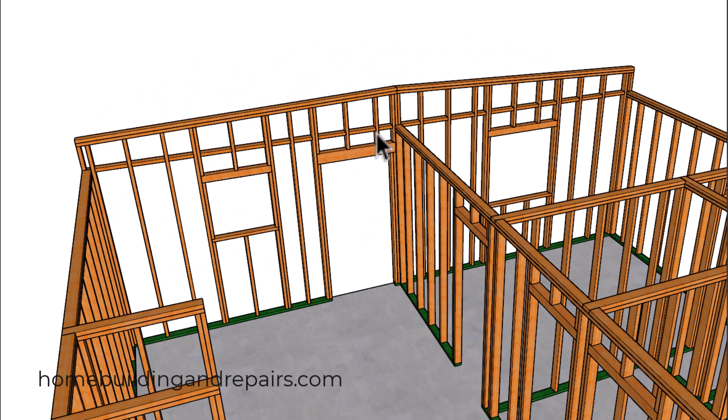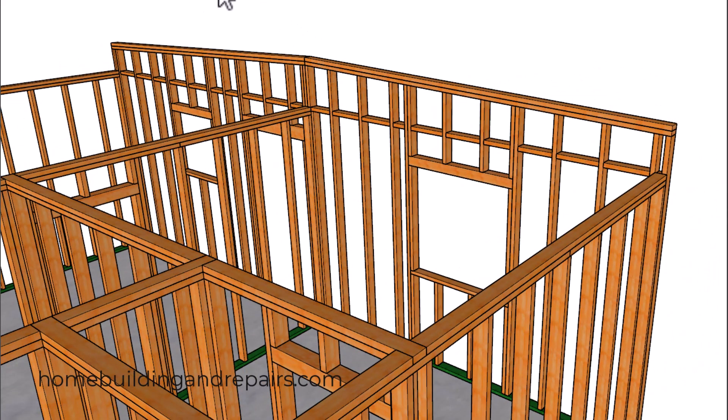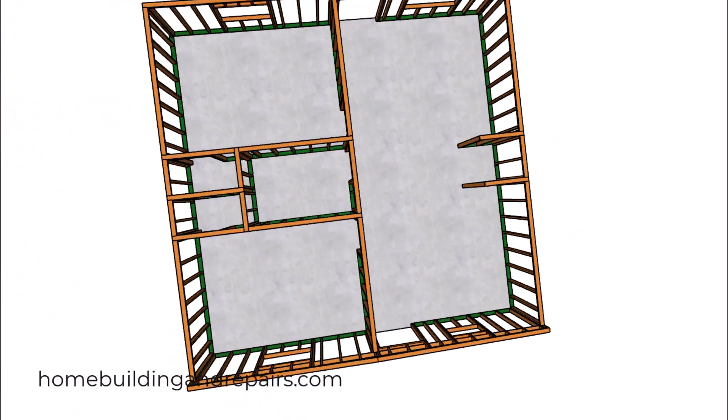We do have fire blocks here, and you might even be able to get away with just using one top plate. I don't see why you would need two top plates here, and that might even provide you with a better connection.